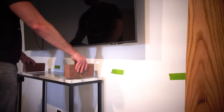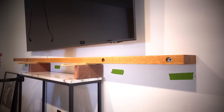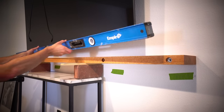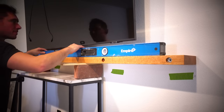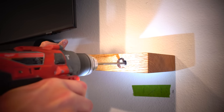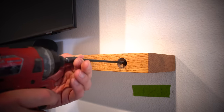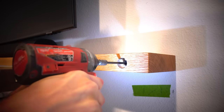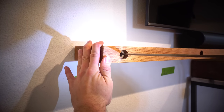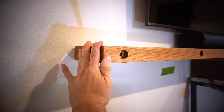There are a number of ways to go about the installation process, but on this project I decided to place the board exactly where I want it first, using a table, some bricks, and a few shims to guarantee proper levelness as well as exact placement. Now that I have our shelf pinpoint accurate, I can start pre-drilling my holes into the stud locations. I suggest pre-drilling one hole first going all the way through into the stud, then vacuuming up any debris and securing our long 8-inch lag screw. Once I secure one side of the shelf I then go to the opposite side and secure that side as well, just to guarantee that everything is lined up appropriately before making my way to the two screws in the middle.